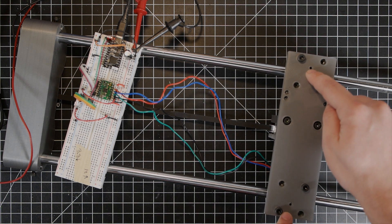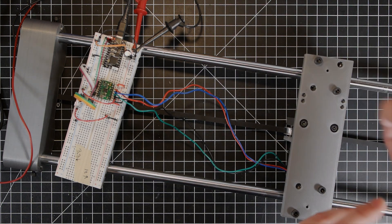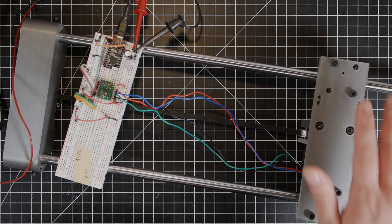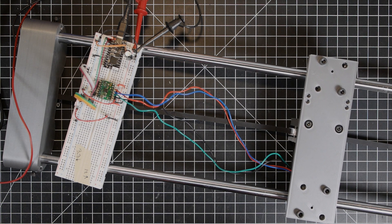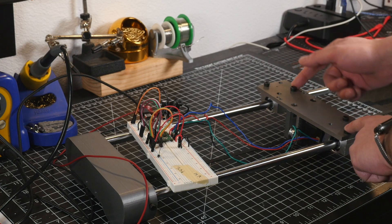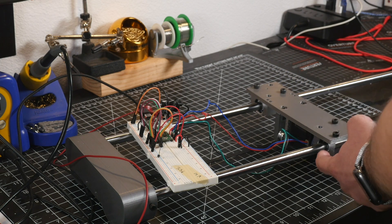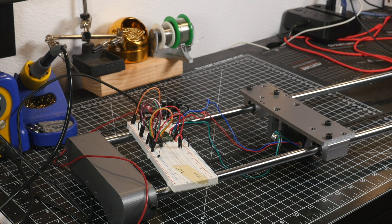However, the perfboard connection is also pretty inconvenient. Right now I would need to remove eight bolts, flip the whole thing over, and remove some nuts just to get the perfboard off, then do the whole thing in reverse to put it back on — and that's a giant pain. I'm going to switch that to embedded nuts as well. And finally, you can see these bolts are standing kind of proud because I made these M3 holes, but they're actually M5 bolt threads in these pillow blocks, so I'll need to fix that.